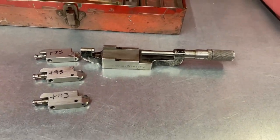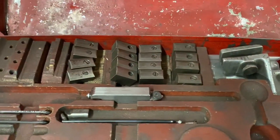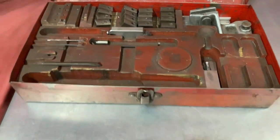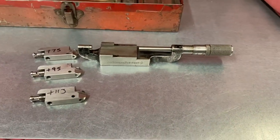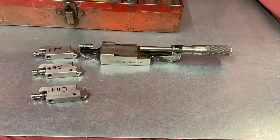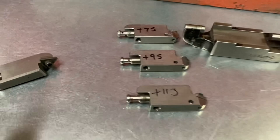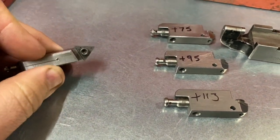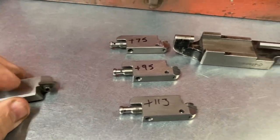I fully recommend those for your Van Norman. I've got a kit with all the cat's paws which do the centering — that comes with the machine. There's a video in my playlists under machine tools specifically on this boring bar. I've also got a chamfer tool, so once we get the bore to finish size we'll put the chamfer tool in and cut a small chamfer on the top of the block.